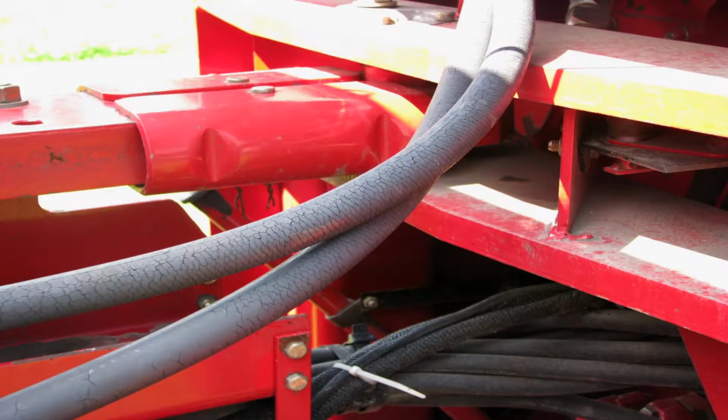And then, like any rubber products that we have, as we were talking about, a lot of our tires don't wear out. The tread's still good, but it wears out based on age. Right. And this rubber dries, and when rubber dries, you begin to get these cracks. You begin to get things like this typical example here, where now this hose is brittle. It doesn't have the flexibility. I'm pumping stuff through it, and so this hose is shot. It needs to be replaced.